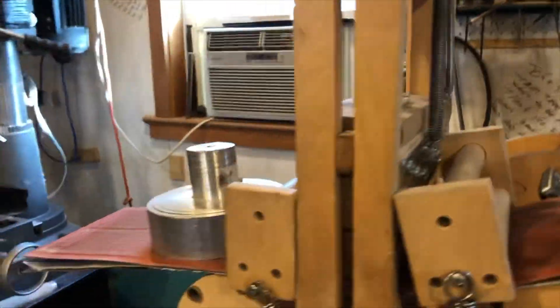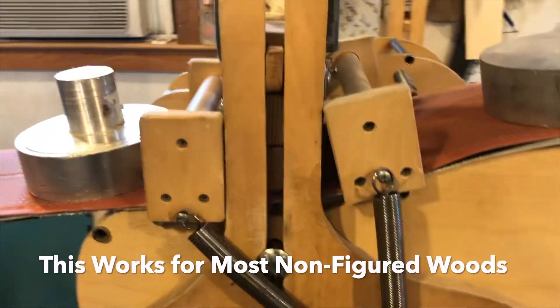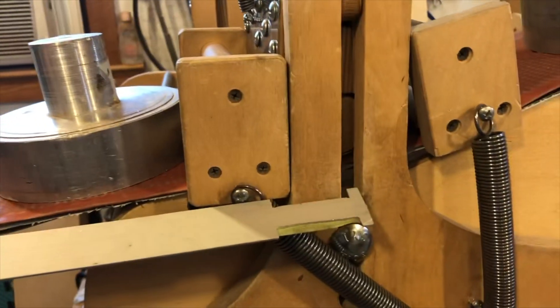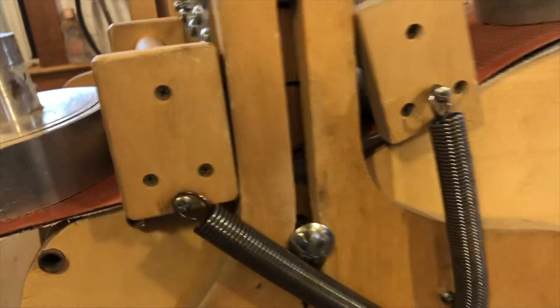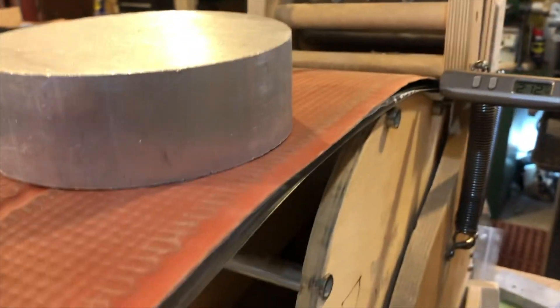This is bending just regular mahogany. Honduran or African will bend the same basic way. I have this little stick that I use — you can see it goes from here to the end of where my wood is. That positions this piece of wood into the bender. When I've set this up, you can see I have the weights on here; they are applying pressure and keeping everything intact.